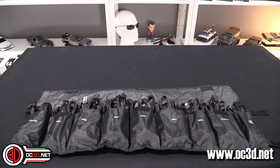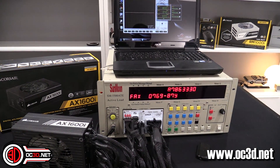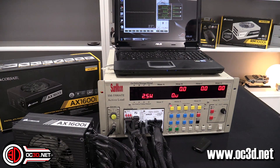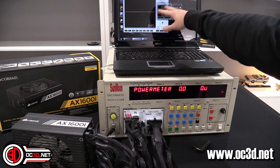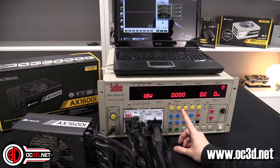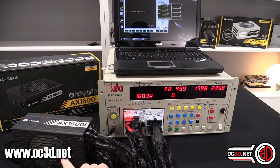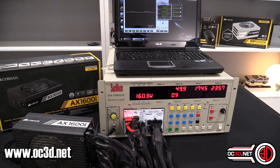So, the good old Sun Moon. This thing does make an awful lot of noise when I first turn it on, so I'm just going to let the fans kick in. The screen will be flashing at you but that's just because of the refresh rate on the screen itself. We're going to keep an eye on the wattage, there'll be an efficiency number, and I'll zoom in to show you the oscilloscope. On level one we've got 10% which is 160 watts, level two is 320 watts, then 800 watts, and then 1200 watts. One thing I'll say straight away - you can see the fan has kicked in, and it does annoyingly do a 100% fan test on startup.